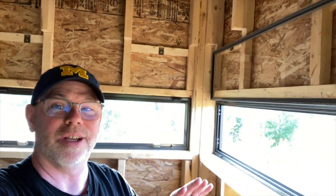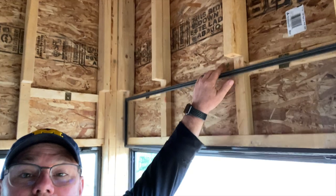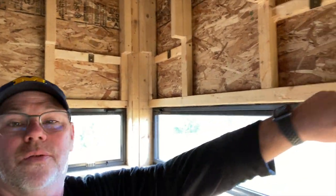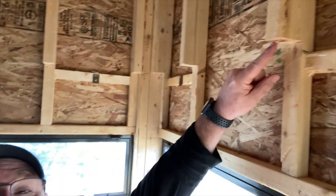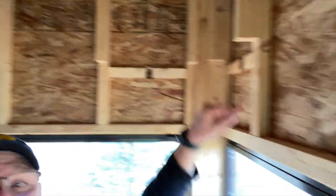The other thing I want to point out is I didn't build this blind myself. I had somebody who's good at construction — a builder — and he built this blind for me. I don't have the skills to do this. One of the things we ran into was when he installed it, you see the two-by-four construction in here — he had it framed with a regular two-by-four, and then we installed the windows. All of a sudden you go to flip it up and it was hitting on the two-by-four. It could not go all the way up. So he notched out all of these studs all the way around the blind. That's not a big deal, but now the window, when it flips up, flips up completely flush.